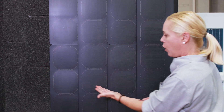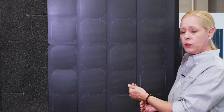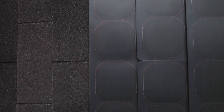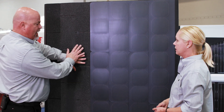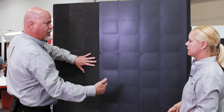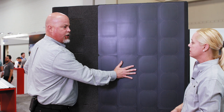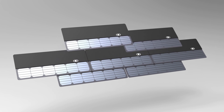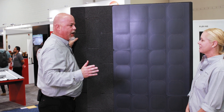This panel extends all the way under with the same butyl adhesive used for the shingle — total weatherization, exactly the same as you would with the shingle. It's a peel-and-stick, just like the asphalt shingle, and then it gets nailed in the back. Our shingle also nails in the back. Easy installation — the installers are familiar with the method, so it's going to be quick and easy, just the way the shingle is. Rather than a solar panel trying to masquerade as a shingle, what we're really doing is creating a construction material — a roofing shingle that's performing all the functions of the solar panel.